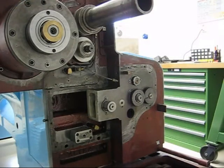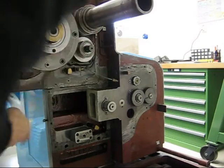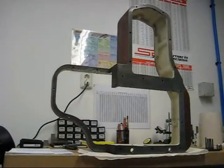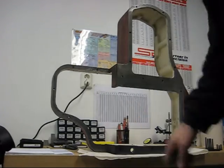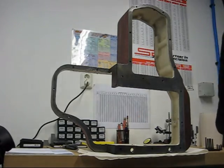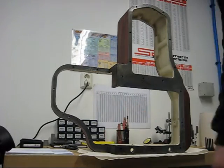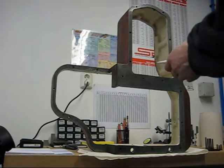Here is where the casting for the change gears is going. It needs to be cleaned because for some reason I haven't cleaned here properly before, especially not in there. I need to clean the gasket face with thinner, then we'll try to put it on. I'm ready to put on the sealant — it should be plain sailing around there. There's the gasket and there's the gasket — that one should be okay. But down here it's a problem. The tactic will be to put on sealant really heavily on this face, and maybe put on sealant from the inside after I've attached the casting to the machine.